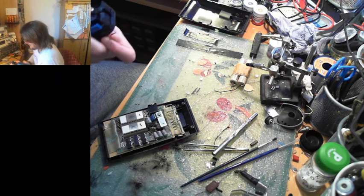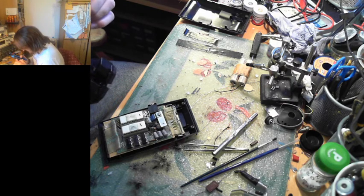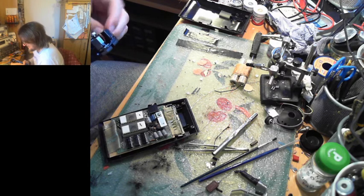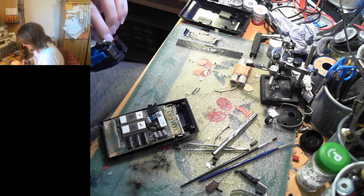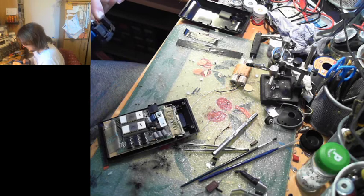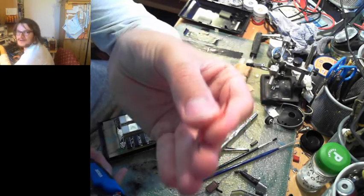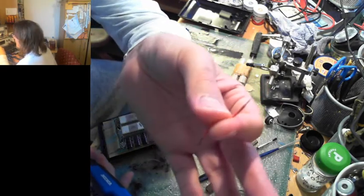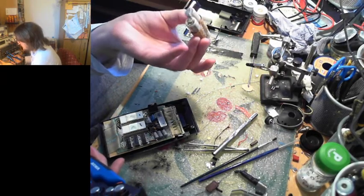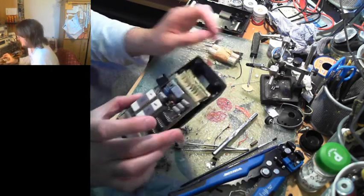Nope. This cable's so rooted, it won't even strip. There we go. Oh, yeah, it's got the classic NiCad battery grot on there that makes the cable basically useless. Oh god, yeah. This end isn't so bad. But if you look, you can see that one end has gone black, and I can tell you from experience, that will not take solder, because there's always a positive end that leaks, because that's where the seals are. We'll actually take apart the battery pack, because it seems to be comprised of four smaller cells.